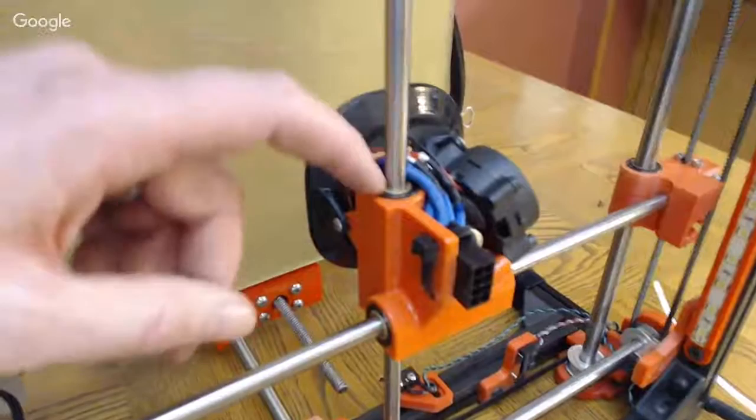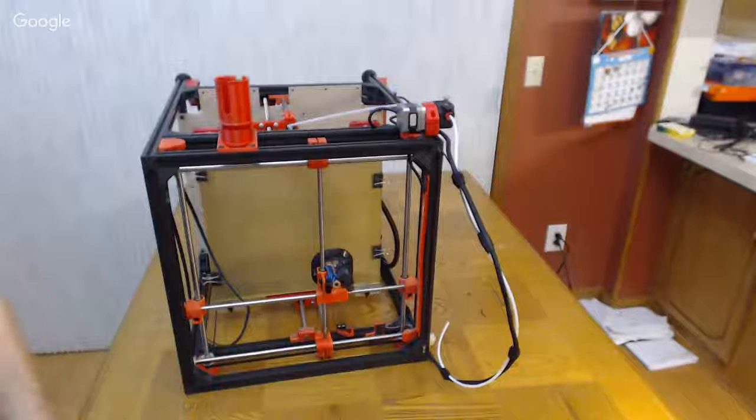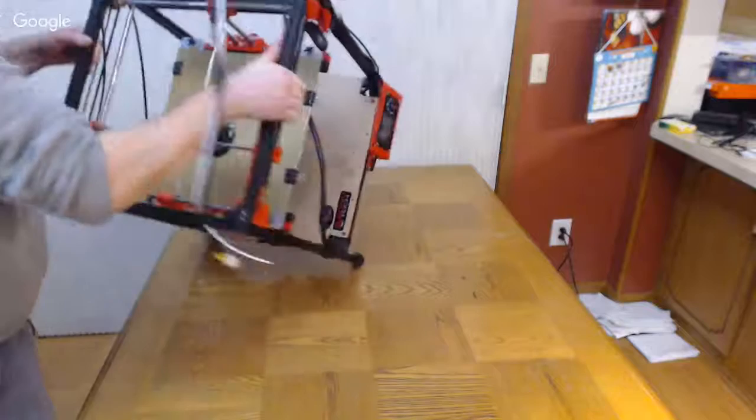Then you let it kick. It takes quite a while to kick back over. I probably wouldn't even think about putting it in a printer for a day, but once it's hardened back up, it's really locked in there. It's like you glued it in, but it also doesn't have the chance of splitting the ABS print, which can be problematic. ABS is a lot more prone to that, the interlayer bonding being not quite as good as maybe a PLA or especially a PETG.